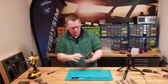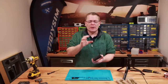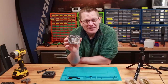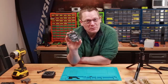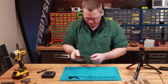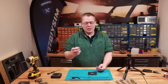Good — now it's a completely secure unit. We needed to build this first because it's going to set the depth of all the electrical components. We can put our assembly to one side and pick up our PCB. This does state 'Chrono version one' but it's actually version 1.4 — there have been three other revisions before I kind of got it right. For this project I'm going to use yellow seven-segment displays — they're four digits long and common cathode.